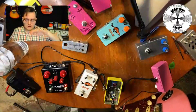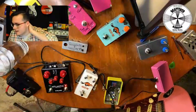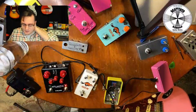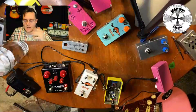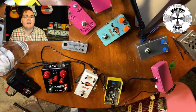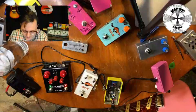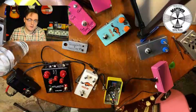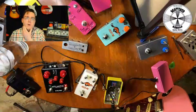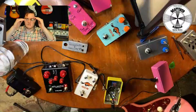This is super pulled down and settled compared to that. Jason, yes, there is a lot more gain. Those germanium diodes didn't produce a ton of gain. They did, but not a lot of headroom. And I know what you mean by that. So I actually added a different diode in there running asymmetrical with those germanium diodes. What that means is making the waveforms less even across the board.